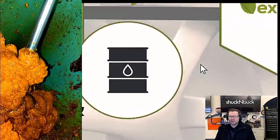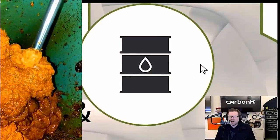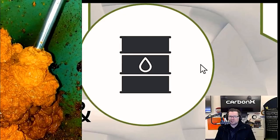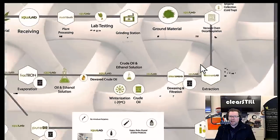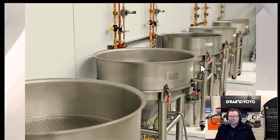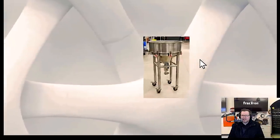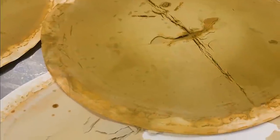Here's another example of another line. You get barrels and barrels of crude oil out — all looking good, smells wonderful — and you have gallons and gallons of terpenes coming out of your vacuum oven process. So now you want to de-wax it. We'll use these large-scale Buchner funnels called drain droids, which allow you to remove the waxes from the crude oil through a process called winterization.